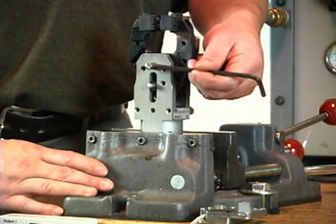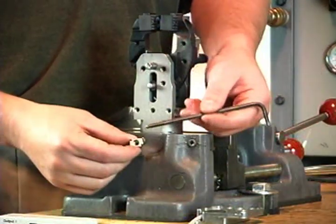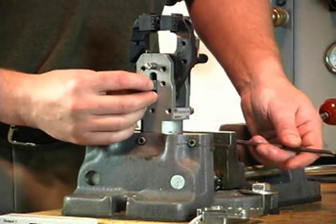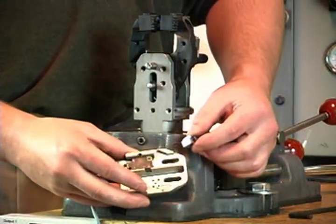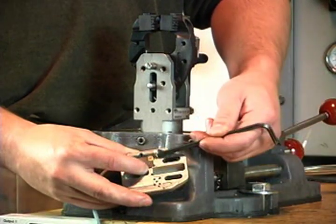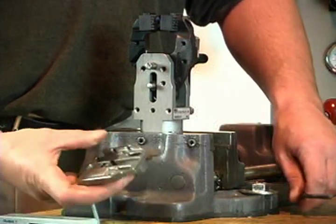The panel present detection option requires a longer pivot pin and drive pin. The elongated slot on the back of the target mounts to the drive pin. The target is positioned in the housing slot, with the elongated slot on the back of the target facing you. The target slides forward and backward as the clamp opens and closes. As the target passes in front of the switch, the switch turns on.